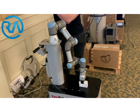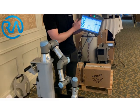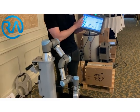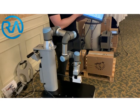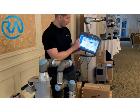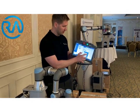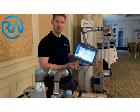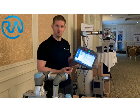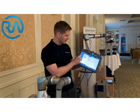And then I'll add another position where it just comes up. I want it to go directly up, so for that I'll just press the up arrow. Once it's there, I'm going to put a wait command in — I'll just do wait for three seconds. But you can also use a digital input or analog input, which could be a sensor or a machine signal, to wait for something before the next operation.